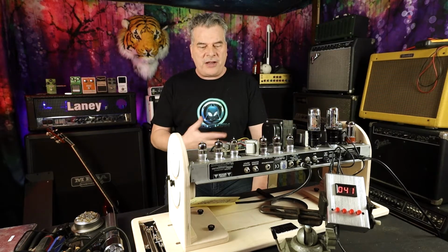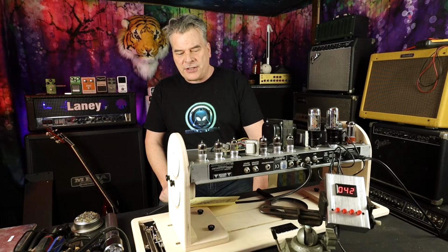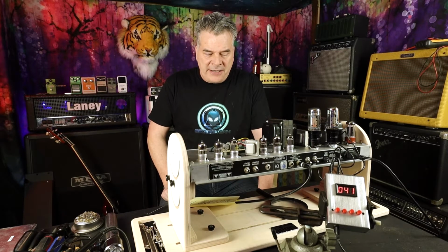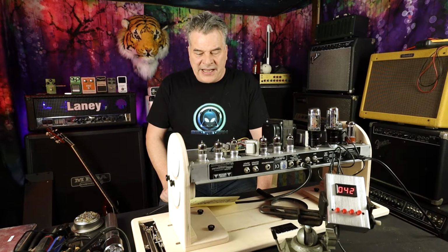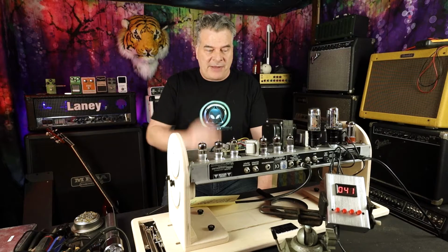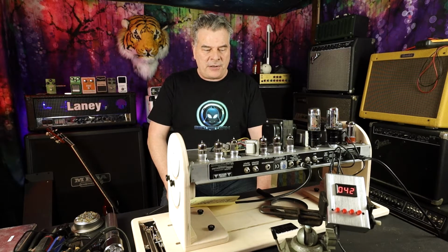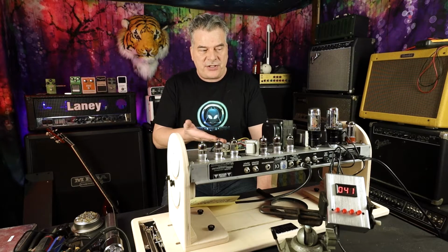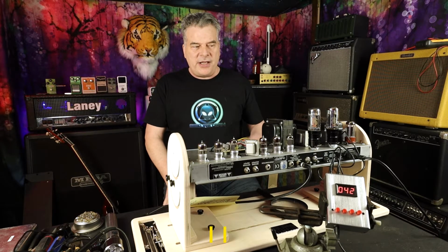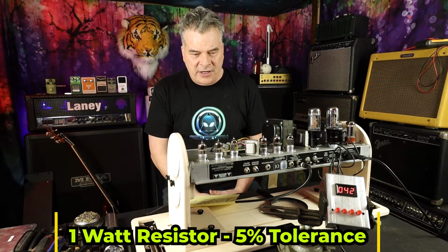When you think about these amplifiers, the pots typically have 10-20% tolerance. A 20% tolerance on the capacitors is perfectly normal. That's just sort of how these things work. So even though it looks like everything is wildly off, I'm actually perfectly fine.